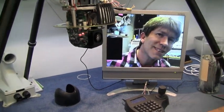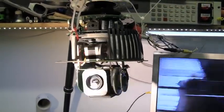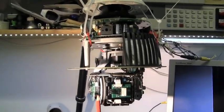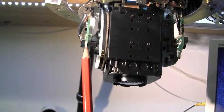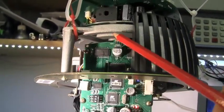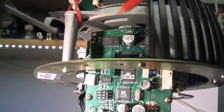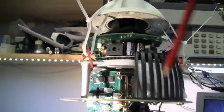The electronics in this are really nicely made. Every time the camera powers up it'll do a couple of tests to verify its position. Here is a transmit-receive infrared device, and you'll see a small blade goes up and sits in between — when it reaches that point it knows exactly where that camera is pointing. The same can be said up here, although that's a magnetic device passing a little magnet on the base plate. It'll go past that twice and verify where zero is in its 360 degree field.